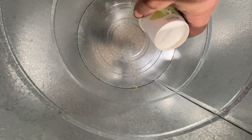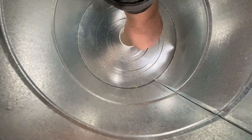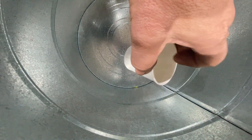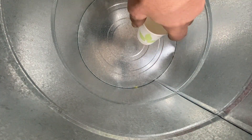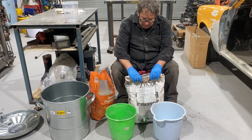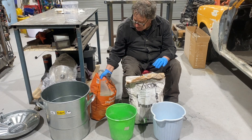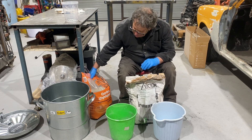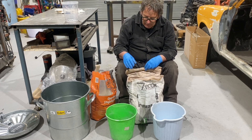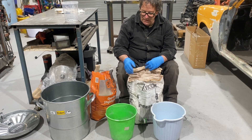The first thing I'm going to do is glue down this little cup in the middle — that will give me the drain hole. Then I can make a plug by pouring some plaster in with another cup. I've got casting plaster, which is like plaster of Paris, and a bag of coarse gardening sand to give it some binding. It's a half-and-half plaster and sand mix with water.